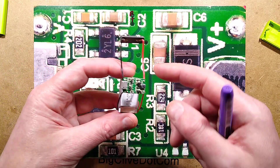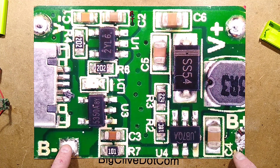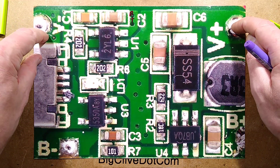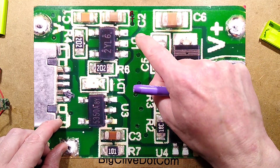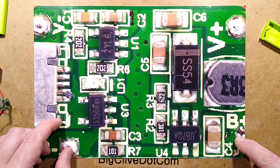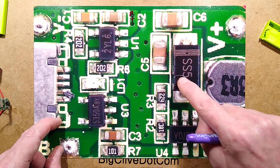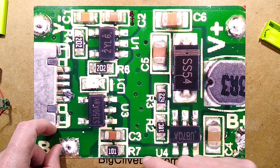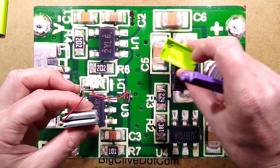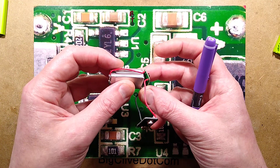Things worthy of note: the battery connection and output terminals go on the long edge of the circuit board. Battery negative is here, battery positive is here - that's the lithium battery - then output negative is here and output positive is here. Most of the back of the circuit board is a solid ground plane, with the only track on the back being from the battery positive, which is deliberately mounted right next to the switching boost circuitry. That track then goes across to the charging circuitry and protection circuitry. The wires fold down at the side and run up the side of the lithium cells.